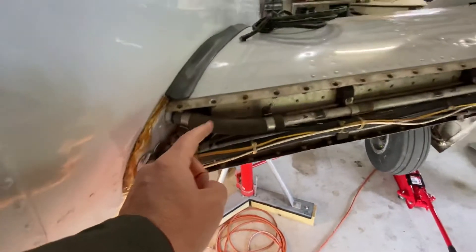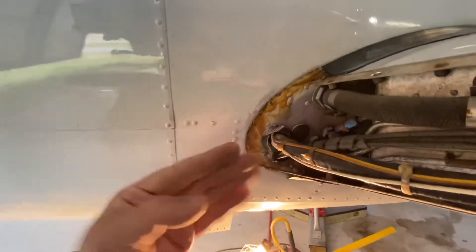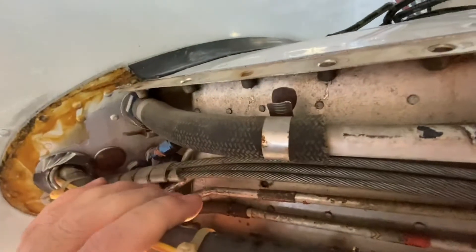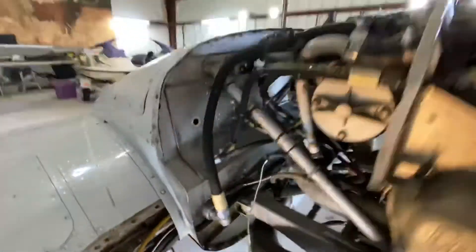The replacement comes with everything all the way, including to the micro switch. I've opened up all the access panels all the way inside, all the way down through the floorboards where this comes out and the cables run underneath. The cables are right here and they go into the fuselage, then around behind the rudder pedals, and up to the dash where the throttle quadrants are. You have three mechanical cables — one for prop, one for throttle, and one for mixture. On this one, the throttle, where the cable goes into the swage fitting, it's starting to come loose.